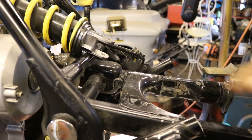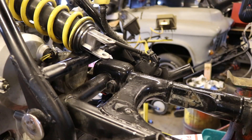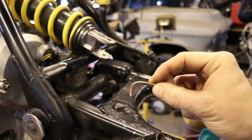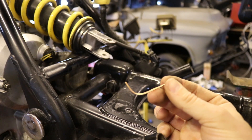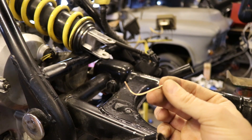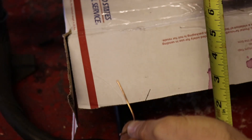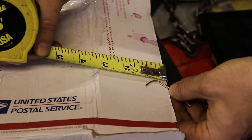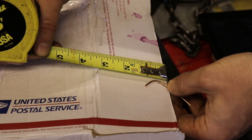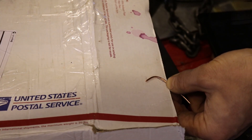There's a little curve here that goes down. The way I did it was I simply took a little piece of copper wire, held it, and bent it around. Then I take my angle and transfer it onto my template. My pipe is only going to be an inch wide, so I adjust my curve accordingly and I should end up with something approaching the correct angle.